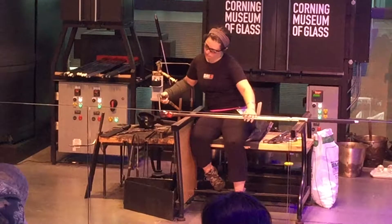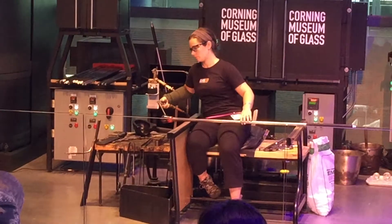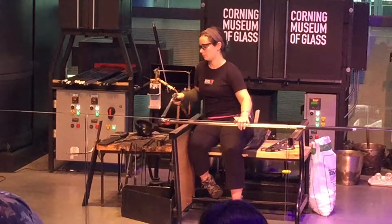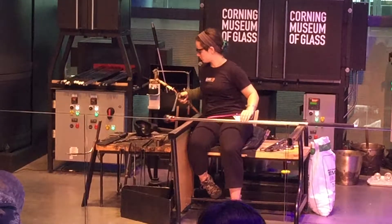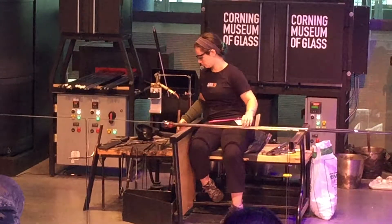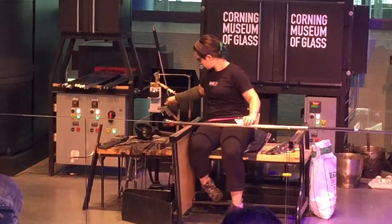During the whole working process you'll see Jamie continually going into our reheating furnace on the far side of the stage — even if it's just for 10 to 15 seconds — giving the entire piece of glass a nice reheat and keeping that glass above a thousand degrees Fahrenheit. That's very key.